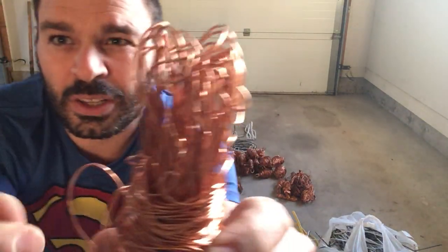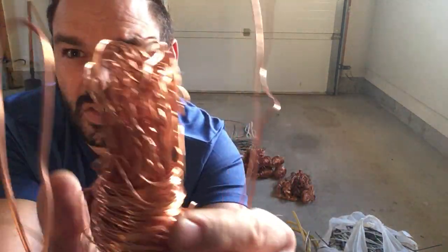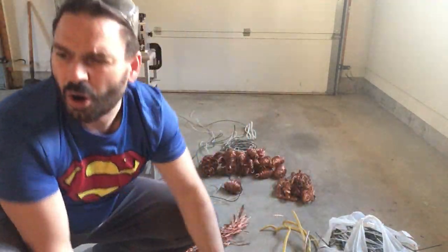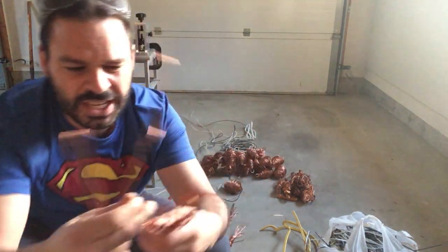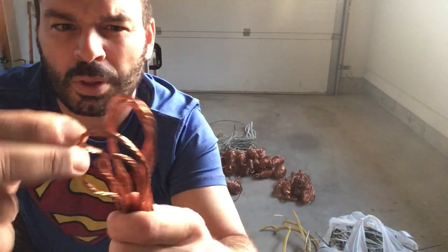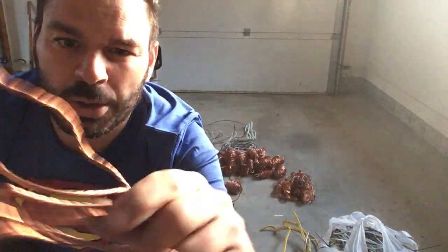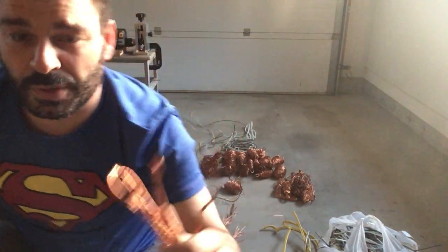Okay, so if I look at the difference, and even here is my basic Romex, the difference. This is your pencil. This is your thicker than pencil lead. This is your really thin stuff. This is gonna be, unfortunately, number two, as is all the tiny hairs on your wires, on your motors. This, even though you can see there are strands coming out of it, because it is clumped together in nice cord, this will still count as number one or bare bright, depending on the scrapyard. But that is your difference, okay?